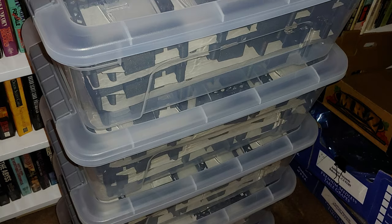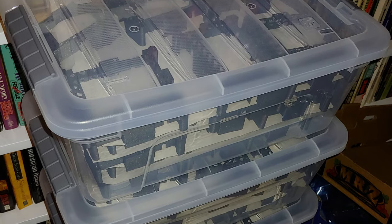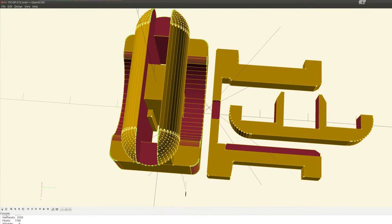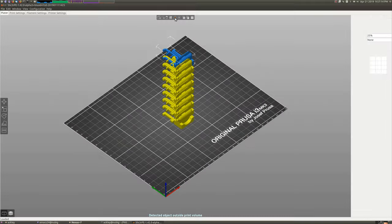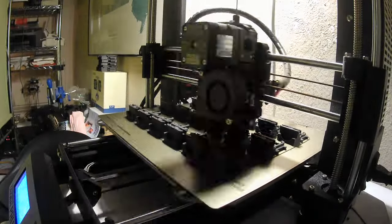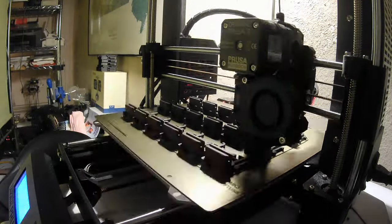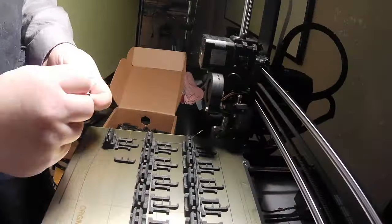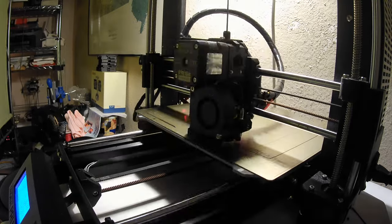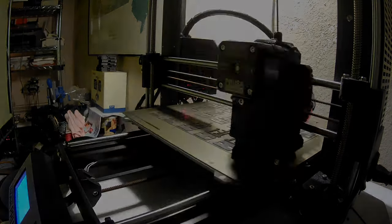Let's take a look. So this was last Friday, 4/19/19. We've now got 5 finished boxes of cases, 180 cases total, which seems like plenty at the moment. And I switched over to printing PD tabs, the handles for the intertile connectors, the ones that carry both P power and D data between the T2 tiles. We need like 500 of these things. A sheet of 18 takes about 14 hours.